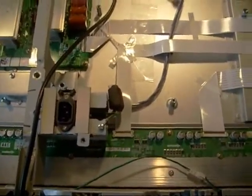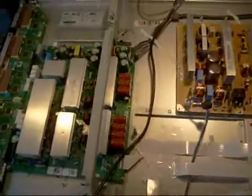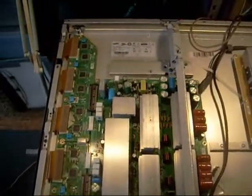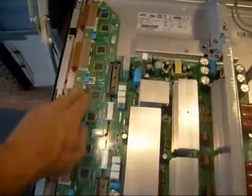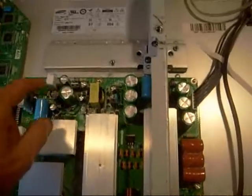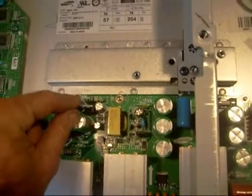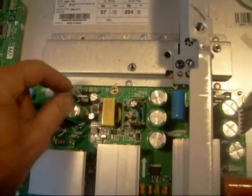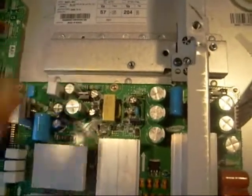We got full picture now, so we need to let it run for a while and see if that holds. That was another valuable lesson in Plasma TV repair: never get carried away and start tearing things apart until you do the obvious first. Check your voltages, check your buffer board ICs to see if any of them are running hot, check your fuses. And that other point about the VSC — I was looking for a test point labeled VSC and didn't realize it was just the side of the resistor here, labeled VSCAN.